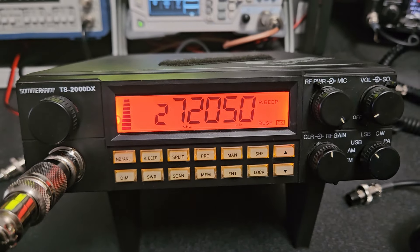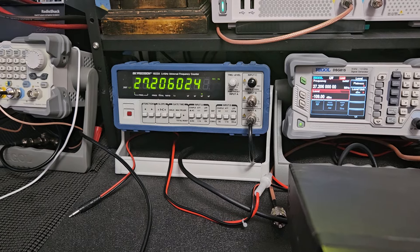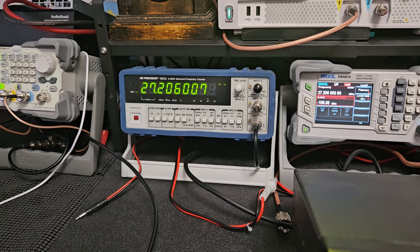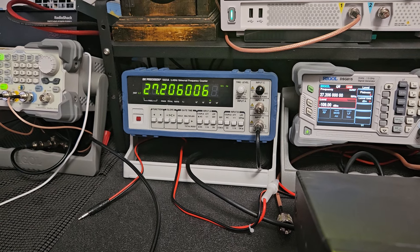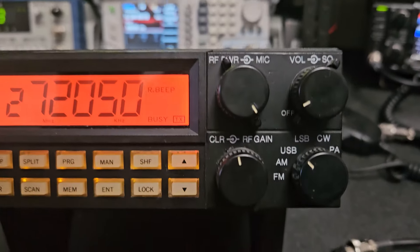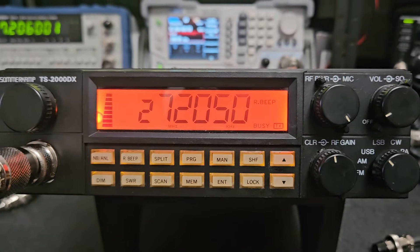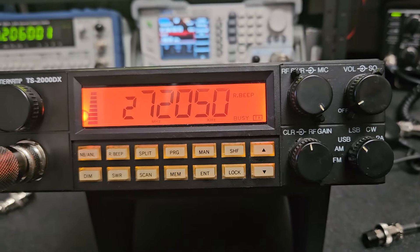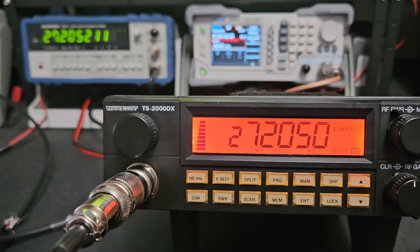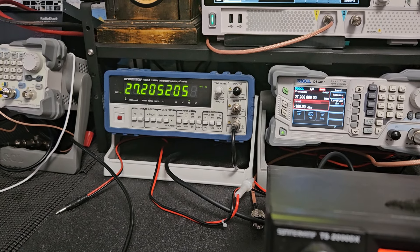Here's upper side — we're looking for about 206, and it's a little higher on the upper side so we need to come down just a little bit. This is normal for these chassis; they've been like this since they were created. It's very usable for what it is. Back to AM at 12 — AM probably still needs a touch-up; we're at about 212 hertz high.